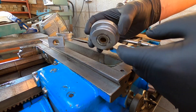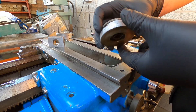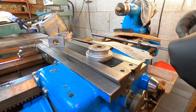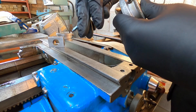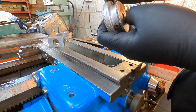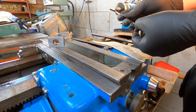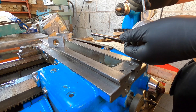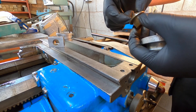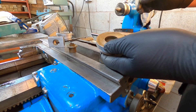So the next bit is the dial, and this is a pain to get out. That bit's come out but that bit sticks in, so we need to take that shaft out because it's got a little spline shaft. There are some allen keys - just undo them. In fact I think these have springs in, yeah these have springs in, so you've got to be super careful with this. Now that shaft now comes out. I'll just need to knock that off and give that a clean.